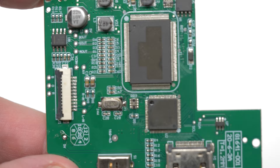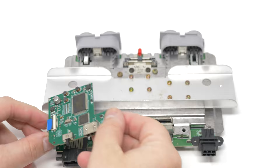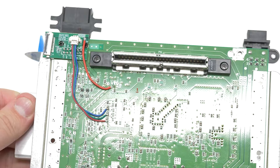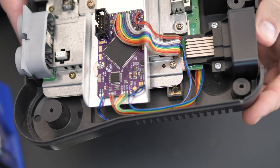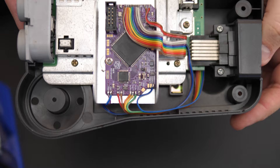Removing the motherboard reveals how they're getting the RGB signals they're converting to HDMI, which will be different based on console revision. Older N64s already generate RGB, but the signals aren't run to the multi-out. For those models, they simply tap RGB from resistors connected to the lines, and they're getting sync from composite video — that fourth wire's voltage. Newer models of the N64 require a much more complicated method to get RGB. RetroRGB.com's N64 section has all the details you'll need.